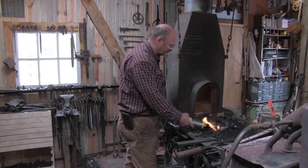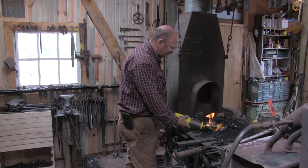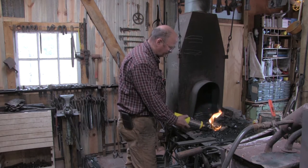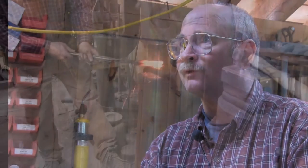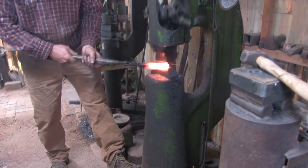But with a job like this, with hot fire and molten metal, one might wonder what some of the dangers are. Probably anything that involves machinery — rotating machinery in particular: grinders, buffers, wire brushes — things that are common in lots of other industries but they can grab pieces and throw them. It's easy to get burned working at the forge, but it's also fairly easy to avoid, and usually the burns aren't really all that bad. The more serious injuries you hear about in blacksmithing almost always go back to a piece of machinery that somebody didn't give proper respect to.